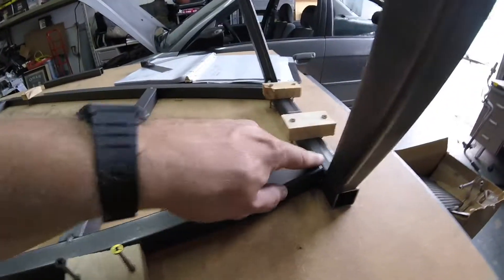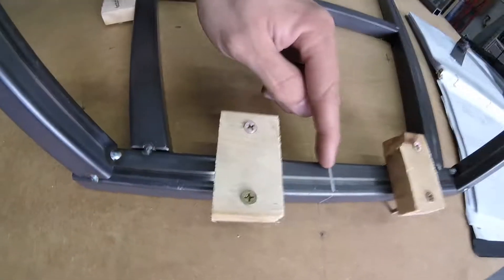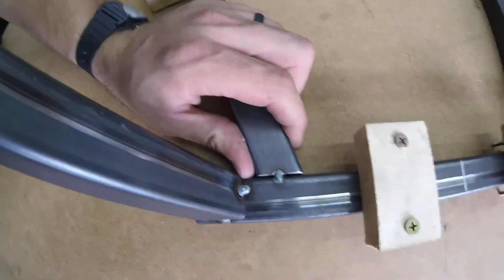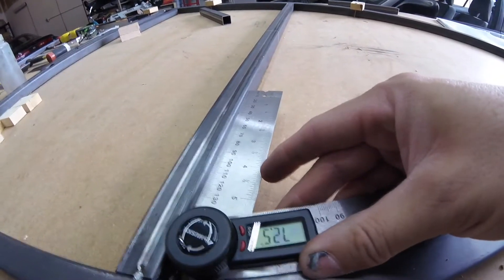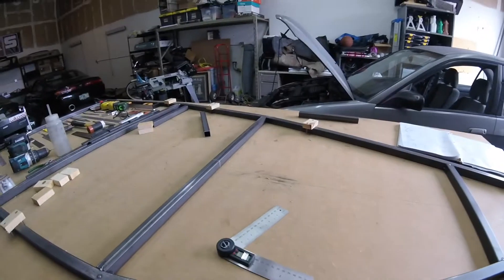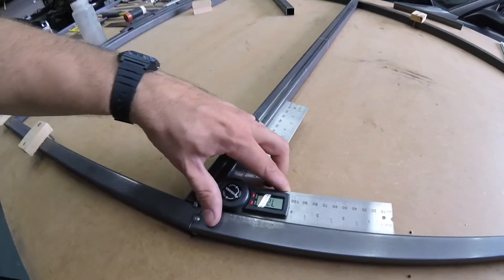I had to do a little fudging over here — I had to kind of squeeze it in to get these two distances the same. Really it should be from here to here and from here to here the same, but I measured from the edge of the tube. I had to scooch it with my hand and screwed the block in to hold it, so this tube gets bent just a little bit. This angle came out 72.5, so I have 72.5 and 72.7 — splitting the difference from the target of 72.6.